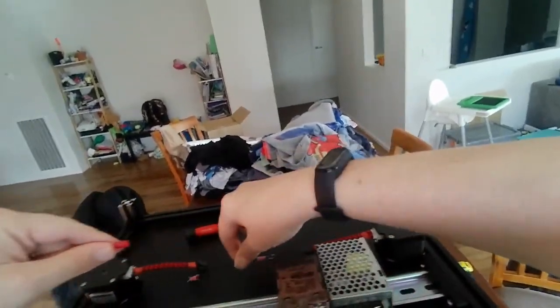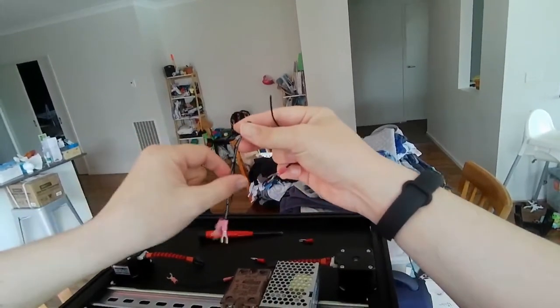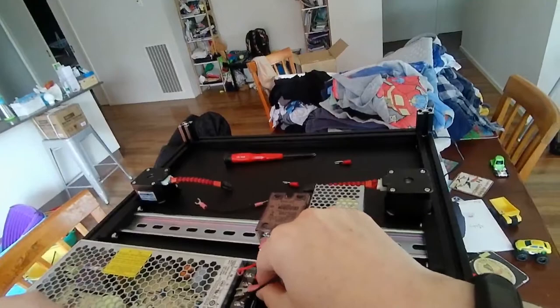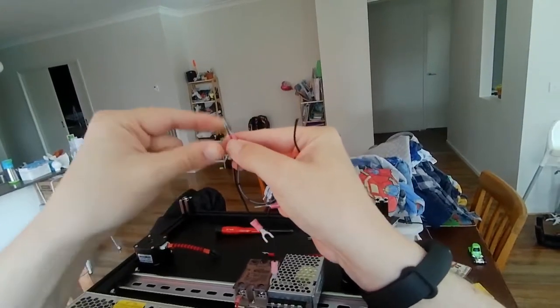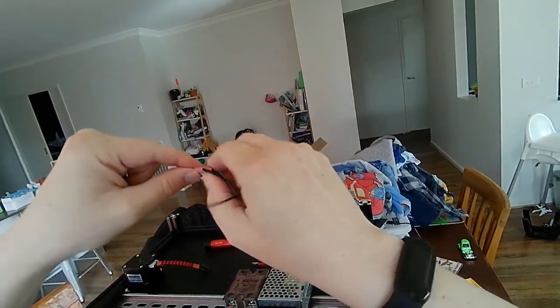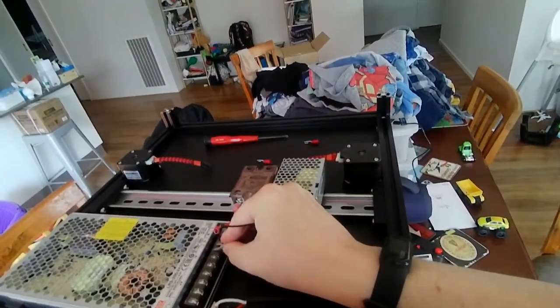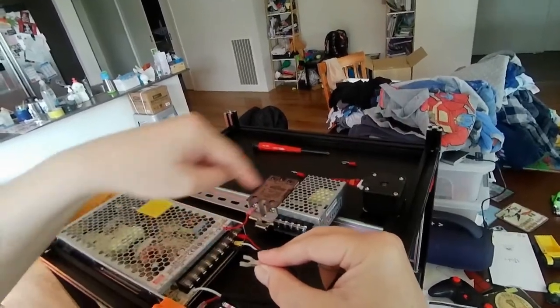So now I've got this. Here are some connections that I had done earlier. Ideally I should have covered these, but there is an indicator on here for which one's ground. We know that this fits on here. Quick tip: if you're doing multiple of these connections and you want to connect two into that bit, flip them over in reverse and then bend them a bit so you can have two in the one spot. Now you might be thinking ahead and go - hang on, this is a problem - because we actually have three connections sitting on it: one for the power inlet in, one for the heated bed, and one for this. I don't know the answer to that - I'm going to jam it in and see how it goes.